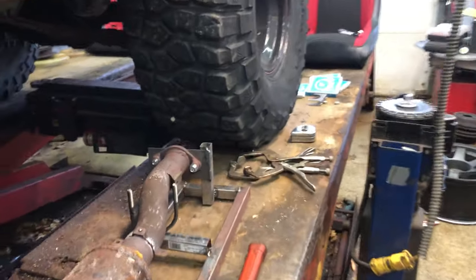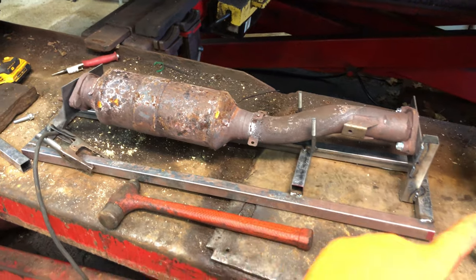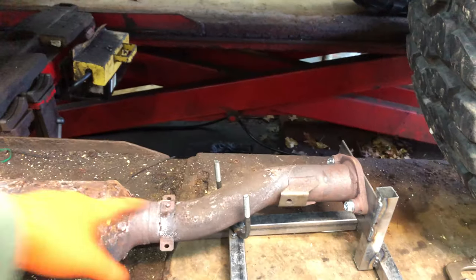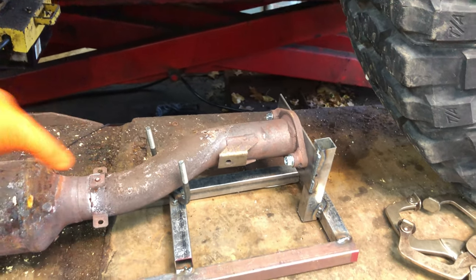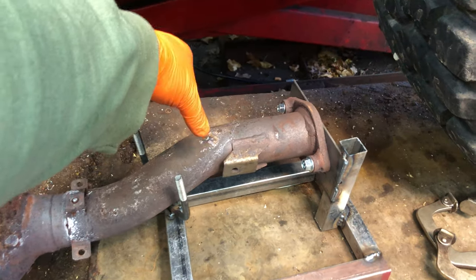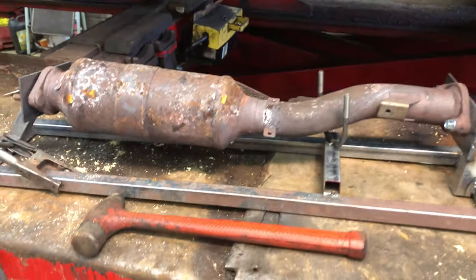Alright, so that's the end of the jig here. I'm gonna finish welding some of the spots, but the idea is so that I can bolt a three inch there, a three inch there, and this is more or less a locator to know that it's got a kick. So if the pipe comes straight off I'll know that I have to come through here and then a straight piece right here — so I just gotta get that.